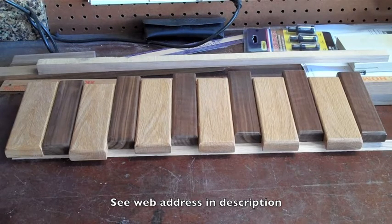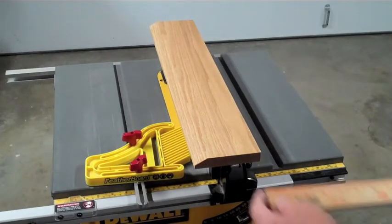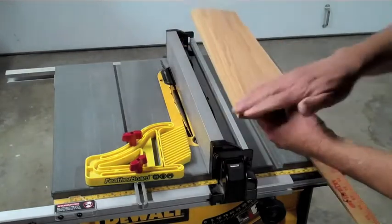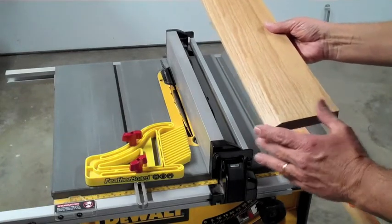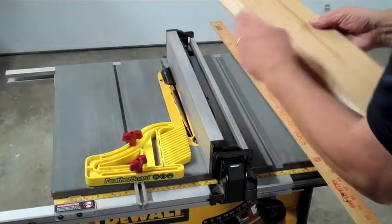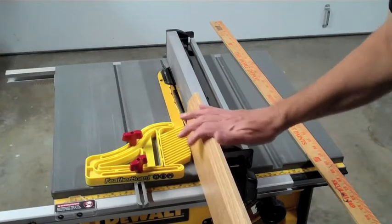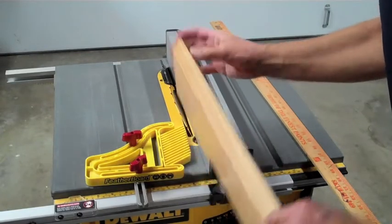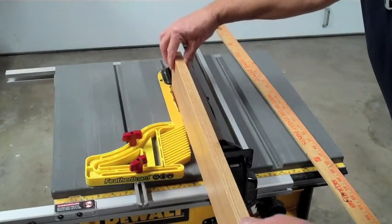One of the first alterations I made: I got a two-foot long board about five inches wide and ripped it to exactly four and a half inches. I needed to put a bevel on the edge but I didn't have the router setup shown in the other video, so I used my table saw set at a 30 degree angle. With some finger boards to keep it tight against the fence, I ran it through the blade and got a nice 30 degree angle — that's what we use for this particular hat rack.